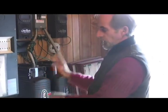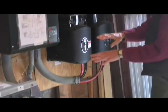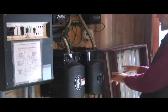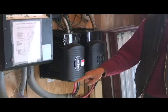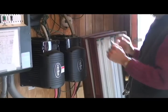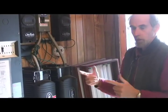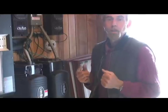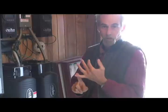When you turn the system on initially, all the power goes into charging these batteries up. Once they are full, all power generated gets fed into the power grid. Should the power grid fail, these inverters switch over to the battery bank. The battery bank then feeds certain circuits assembled in what's called a critical load panel. The inverters feed the critical load panel — circuits we cannot exist without, such as the well pump, heating systems, computer circuits, and dedicated light circuits.